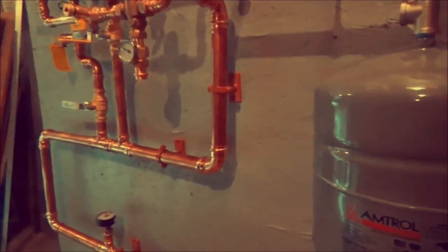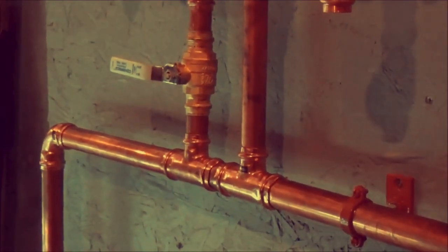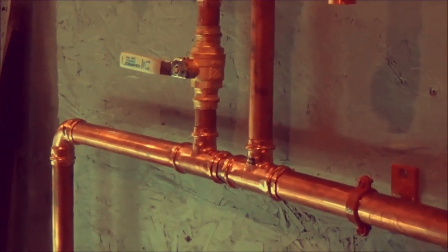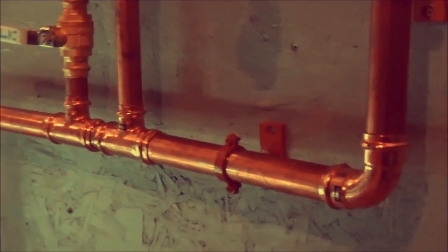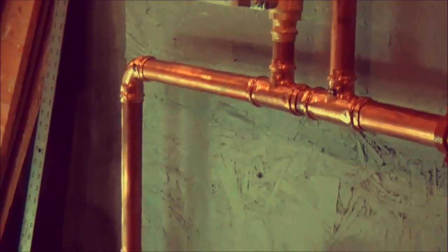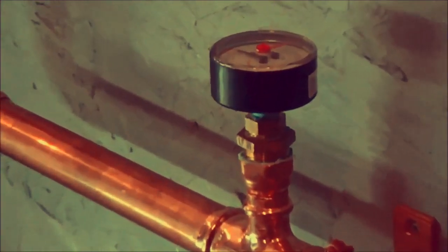And as you can see, let me get you our primary secondary down there with our closely spaced tees. And if you know primary secondary, you know basically it's four times the diameter of the pipe. In this case, it's 4 inches. And then they want at least 12 inches or 10 times the diameter of the pipe to the first elbow. I go 12 inches if possible, which is what you're supposed to do. So on primary, secondary. And that's our drain, T&P gauge down there. Right there.